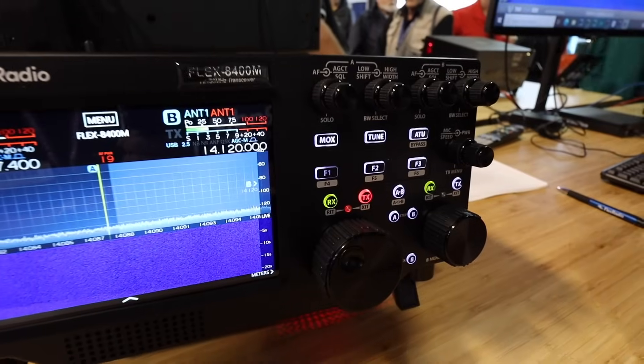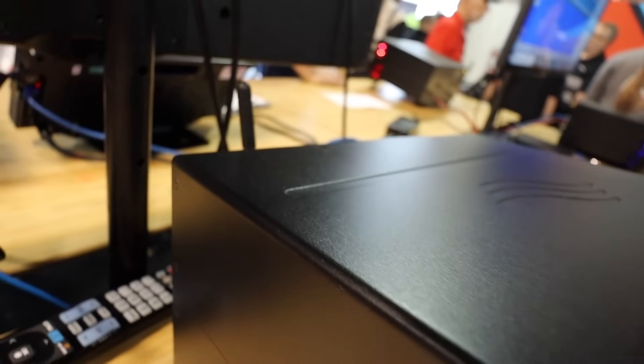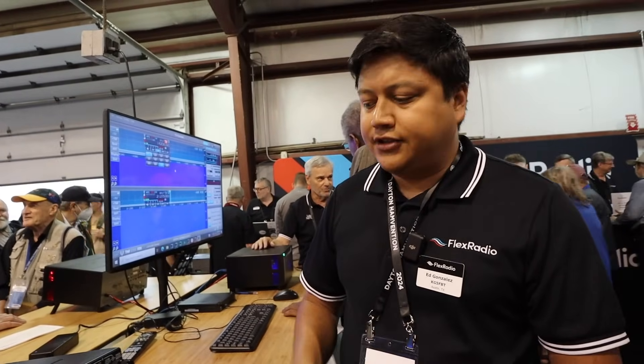This is very familiar from the outside, but the internals have all changed. We have four times the processing power, both in the CPU and in the FPGA. We've done improvements to the PA and pre-selectors. We have an integrated GPS system with a small indoor antenna. One of the big things is that this comes ready to integrate adaptive pre-distortion in the power amplifier. One of my viewers asked about operating with a third-party amplifier such as the KM3KM Mercury Luxe, RF2KS, or any other amplifier that supports pure signal.